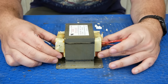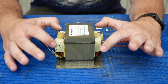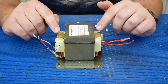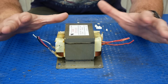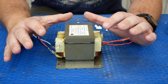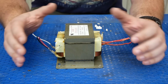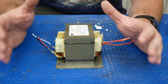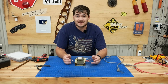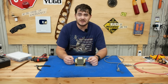This bottom coil is where the line voltage goes in — this is the primary coil, made of slightly thicker gauge wire than the secondary coil. The secondary coil is covered in epoxy and paper, but it's a substantially thinner gauge of wire. The job of the transformer is to step up the line voltage — the 120 volts coming in — into whatever the microwave uses, probably at least a kilovolt. In the process, it steps down the current. Transformers work by a combination of wizardry and magic. Maybe ElectroBoom understands how they work, but I don't.